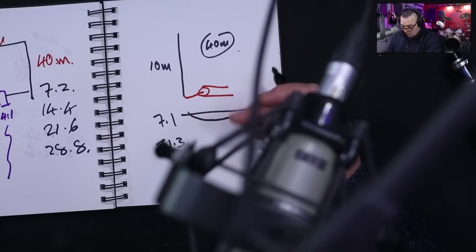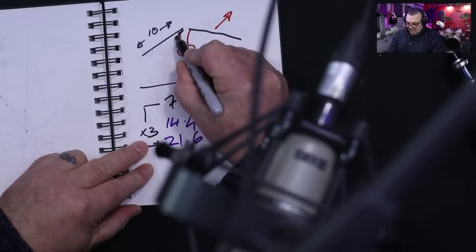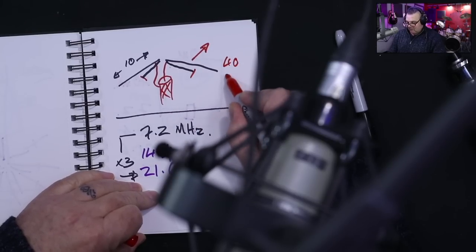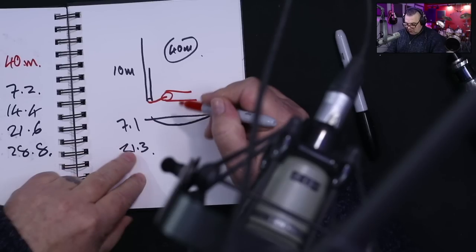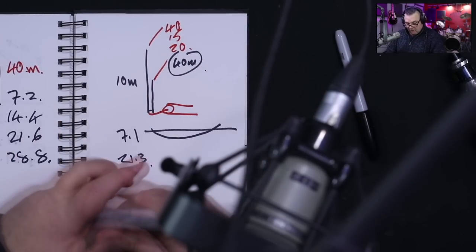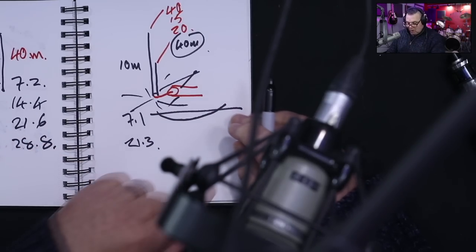What I accidentally discovered down in Cornwall was that by adding another element up the side — like a fan dipole — we can add half-length elements. If the main element is 10 meters, we make additional elements 5 meters long. So now the fan vertical gives us the 40 meter band, 20 meters from the fan element, and 15 meters from the harmonic. The braid of the coax forms our radials.